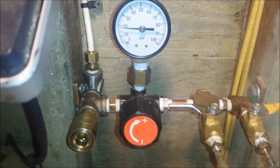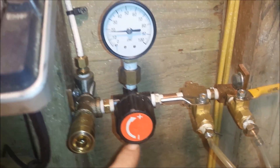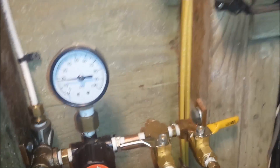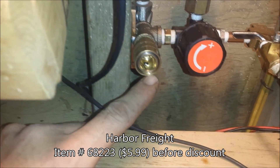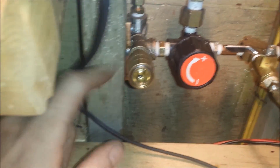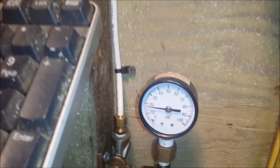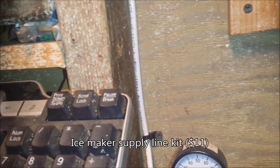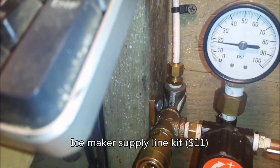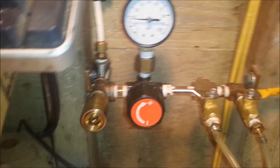I just wanted to show you here — this is my air pressure bus for my steam engines. I have the regulator here; this is a Harbor Freight version, and then a gauge there. I've got two takeoffs with quarter-turn brass valves, and then I've got a high-pressure line for blowing or filling tires. I piped this with a refrigerator ice maker kit — it's a type of plastic piping — and I just tied it all together. It was a little bit short so I had to extend it, but this is the bus.